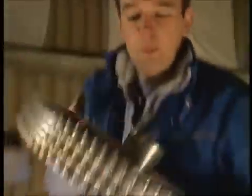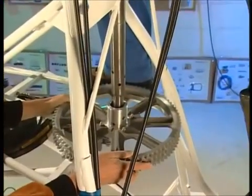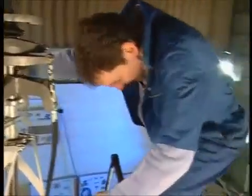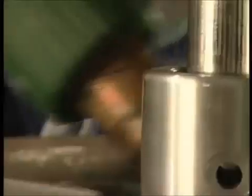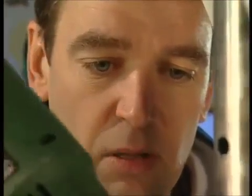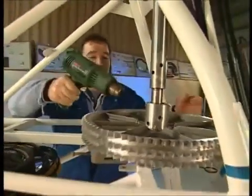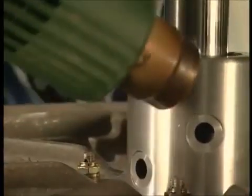Four bolt heads all wired up. I'll do the nuts on the back when it's in position. Pete, can you just hang on to that because this goes on the bottom of the main rotor shaft. I need to just lift it up. A bit more so that it can drop in the middle. Now a bit of heating required — the good old paint stripper. The idea is obviously to heat up the hub without heating up the shaft. It's a bit dodgy putting a hot heat gun between your legs. Thankfully I've got some asbestos underpants.